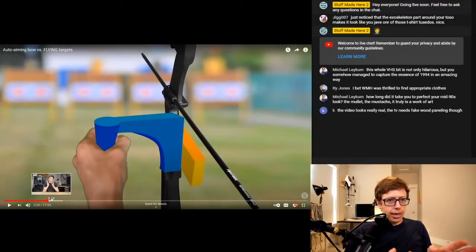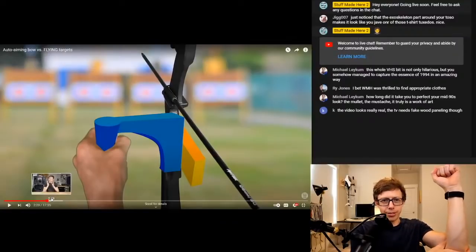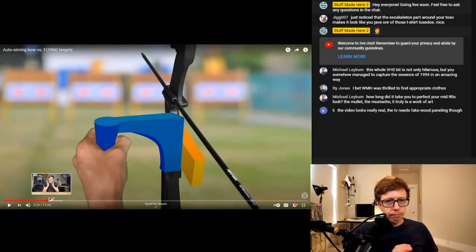The big problem is that even when you put the gauntlet on and pull way out here, your arm is not made to withstand that kind of torque — it really messes up your elbow. I was concerned it was going to literally pull my elbow apart. So I went on the router and made a gauntlet out of sheets that would allow me to hold a bow offset at a variety of different distances from my arm, so I could test it before building the whole thing. I found I could go maybe three to three and a half inches — beyond that it was really painful, and even at three inches, my elbow would be really sore the next day.